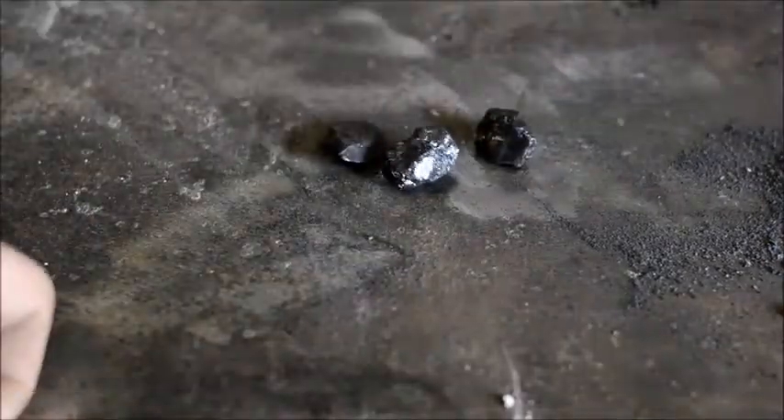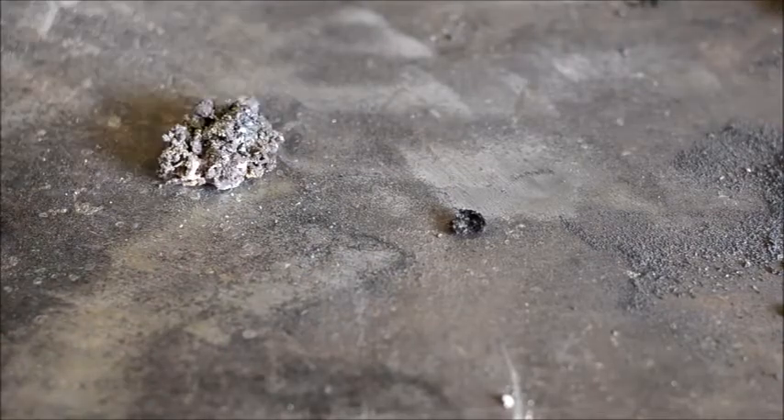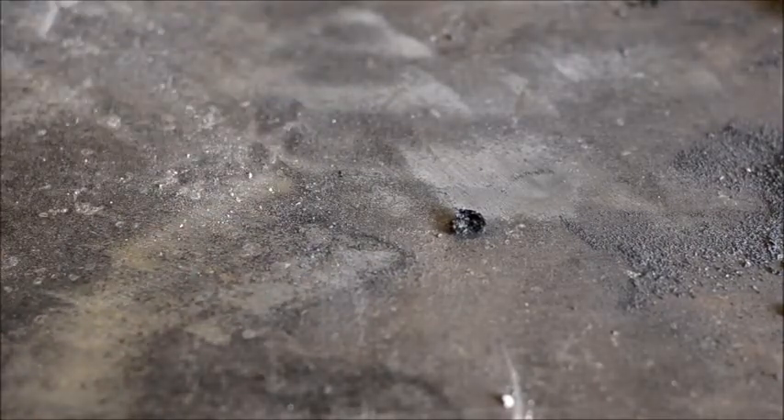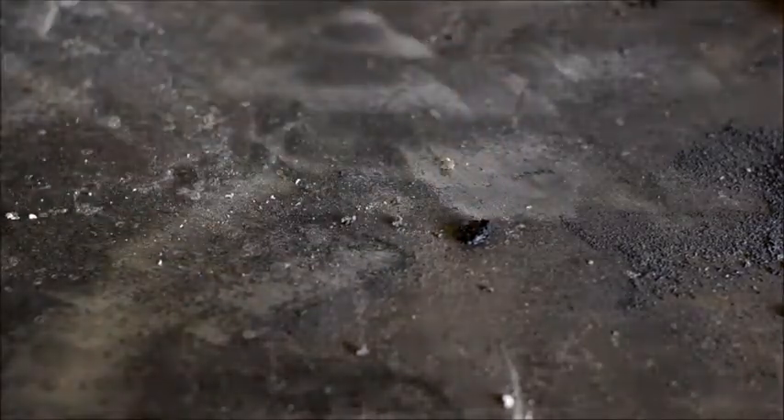Clinkers — no good, don't want them. I'll go over to the forge and show you how to start from green coal to breeze to coke. You won't need to learn how to make clinkers — that's just going to happen on its own. So let's get to it.